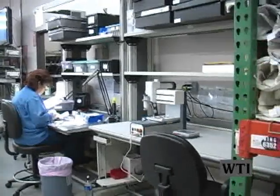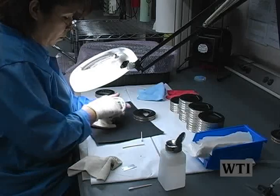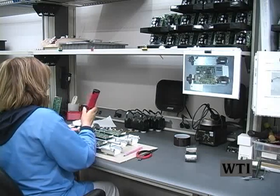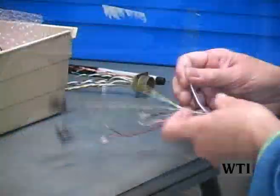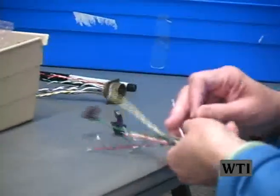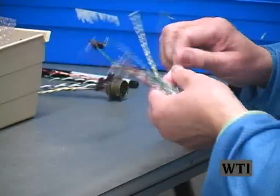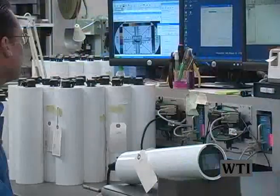Manufacturing work and quality assurance testing in progress. Each of the power modem, power supply, and heater PCBs has a 100% inspection performed after manufacturing and cleaning. Any piece that is found to be non-conforming is corrected by the personnel who made the specific part. A sample of each lot of backplate and lens plate is water tested for leaks before assembly into the cameras.